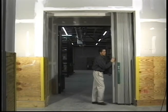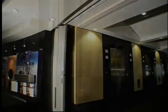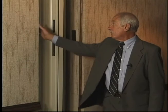Under power assist, by using the actuating device, the force to open the door is only four pounds. This channel is installed only on single-parting doors and can be either recessed into the wall or surface mounted. Most accordion fire door installations are designed with a small storage pocket to allow the door assembly to fold out of view. The fire protection rating of the storage pocket material — these walls — should be equivalent to that of the hourly rating on the door.